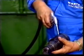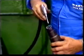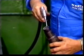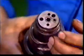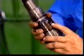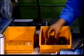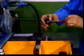Dry the parts by blowing with compressed air. Also the channels in the nozzle holder. Check the nozzle spring. Check also the contact face to the nozzle and the bottom of the fuel inlet hole. The nozzle nut may hold some very hard carbon deposits inside, which should carefully be removed.